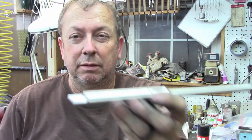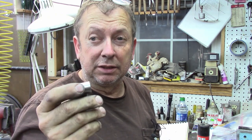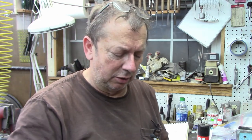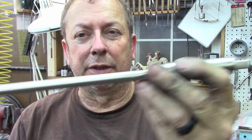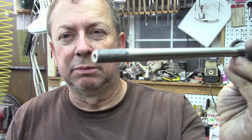Okay, well, this was just a quick and dirty little project, but here we are. That's what we end up with. We've got our adapter piece here, which I haven't seen a drawing for, but every one I've seen is 1 inch long. You know, I would wait and fit this to your machine if you're building this. Otherwise, I think 1 inch long is the standard. But there's the rest of it. I was using a fairly dull cutter on this end just because it was a 3/4 inch cutter. I could run it in one pass. But there we go. So quick and easy project.